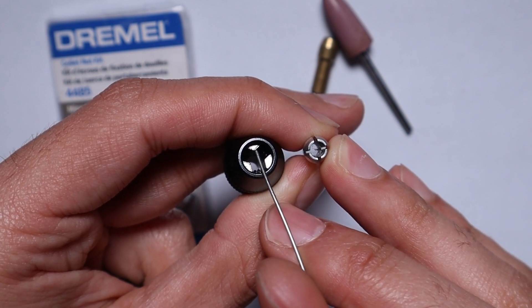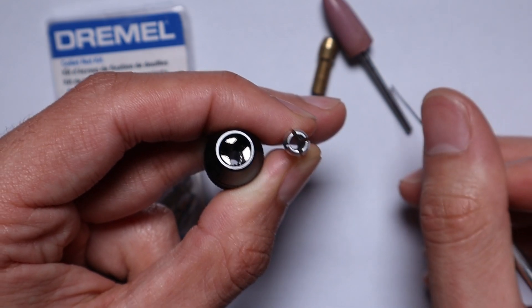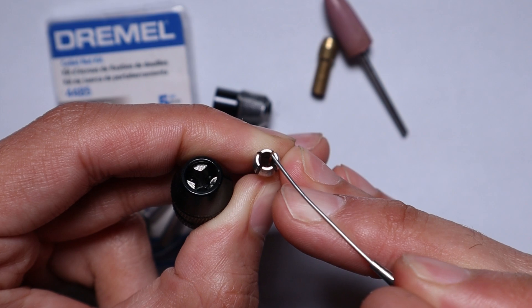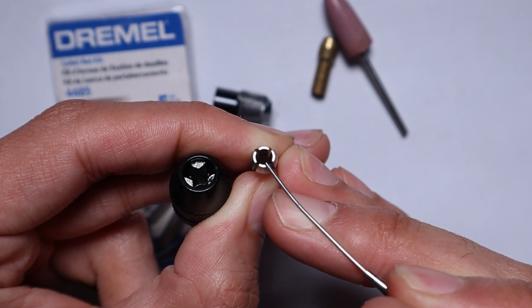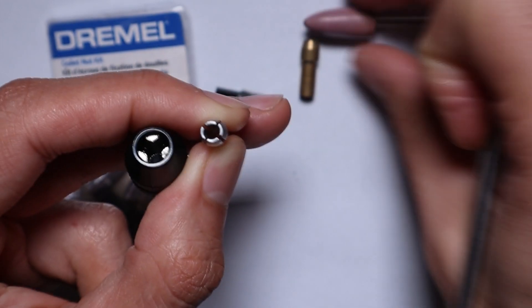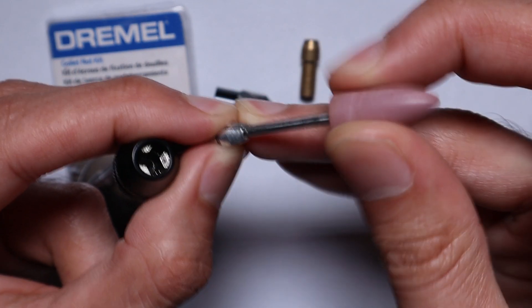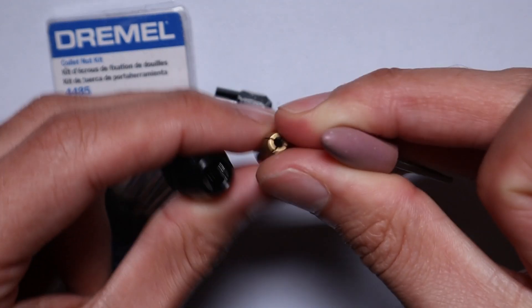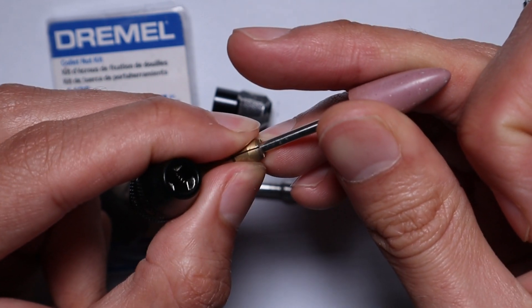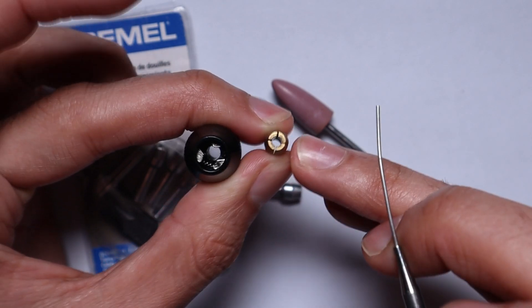Side by side you'll notice a difference. The contact point of this adjustable chuck - and most of them just have three jaws - is that tiny little point on each of the three jaws that's touching your shank. In the case of a collet though, you've got four parts and you're not touching on a point, you're touching on a curved surface. So you've got to make sure the size is correct - you can't shove a wrong-sized collet in and screw it down, it'll just slip around. But if you get the correct size, it goes in already pretty snug, then you just pinch it shut and it's locked in.